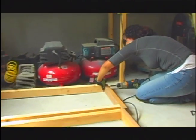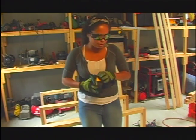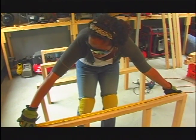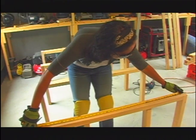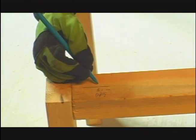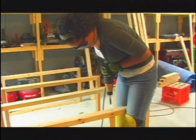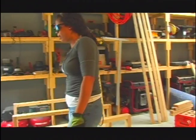So it's got its pluses and its minuses. In order to really center this door and the doorway, I want to measure the inside of the frame right here, and that is exactly 41 and a quarter inches. So my doorway is done on the end.